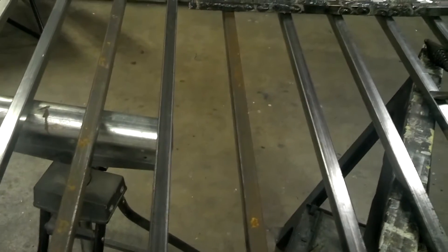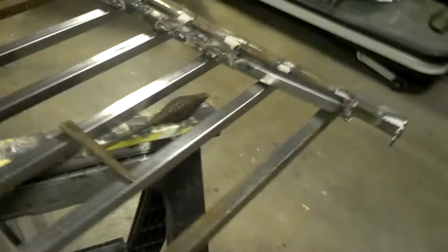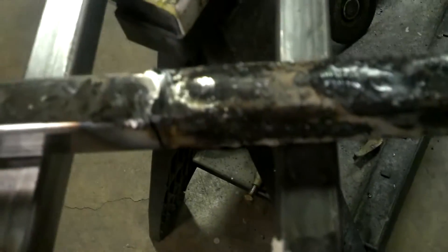So I'm going to go out of my sister's house here where the green is and then around the corner part. That's my update on the welding. I've gotten a little better — it's not as easy as you think. I could grind that flat all the way through and it would, you know, be a good weld — it's got good penetration. I can literally stand on this when I put it on the curb and it won't break. So if I weld it on all four sides, we're definitely good. I'm using a sixty-thirteen rod — sixty thousand pounds tensile strength. I doubt mine holds up to that, but I'm not certified and I haven't been tested.